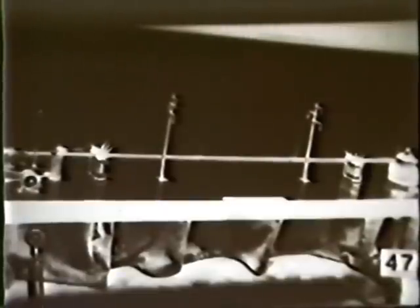You have a turbine there generating the power — actually on the right-hand side you have a hydroelectric power plant. You're generating the power, and then you have a high-voltage transformer on the right-hand side. You're bringing the voltage to very high voltage, low current, transmitting it over distance. Then with another transformer you're bringing the voltage down and utilizing motors and other systems. This is the whole concept of what was done by him.